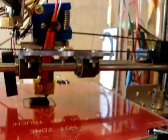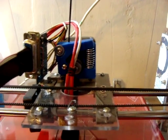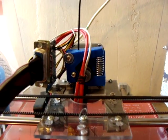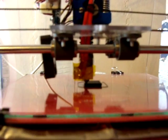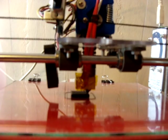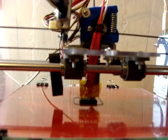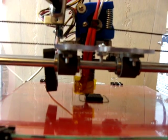Now I'm trying the blue cold end slash stepper interface. It has a 2-to-1 mechanical advantage and a much heavier spring with the PEEK hot end — well, it's not actually the hot end itself but the PEEK connection to the hot end. I think it's called a J-head Mark 4 or Mark 5.